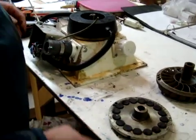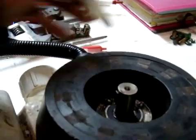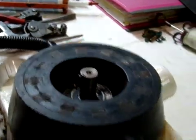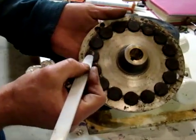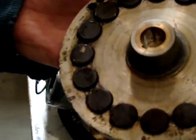The alternator, on the other hand, has been adjusted down too far. I don't know if you can see it on the camera, but there's actually a wear groove worn into this one, and the metal from the pole pieces has been cut down. On the magnets themselves, all that's left of the protective stainless steel can is right here. Now over time these magnets will degrade and crumble and fall off, but it's still usable.